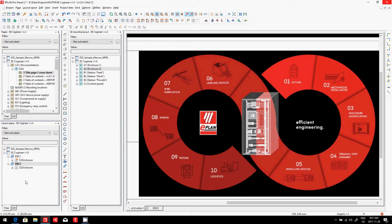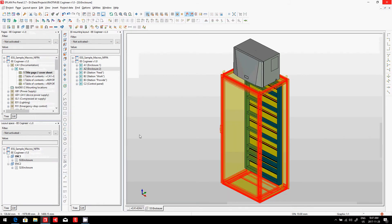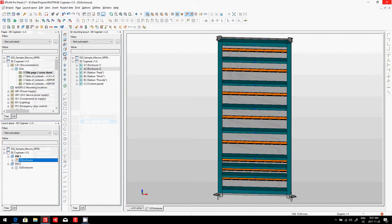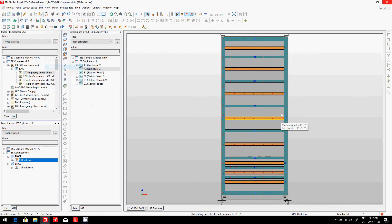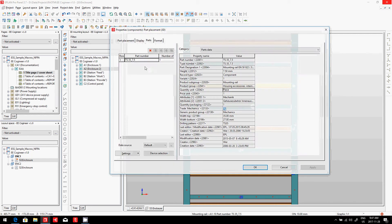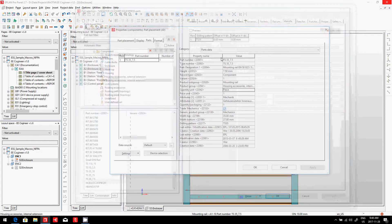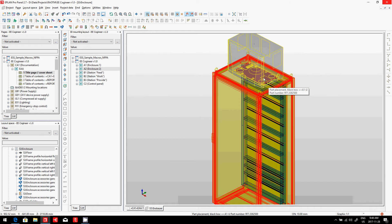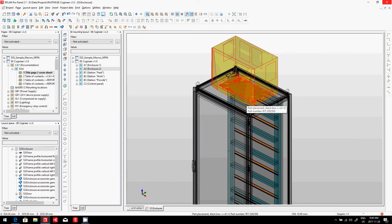How can we prepare this? Fairly easy. When you're back in EPLAN and you actually build your panel layout, I'm going to open my enclosure and work right on my first mounting panel. As I place my components, I automatically have the drilling information that comes behind the scenes. I don't even have to populate the din rail — I already know exactly what I need in terms of manufacturing. This drill pattern specifies what size of hole I need. Everything is there. By placing this component on the roof, we also get some additional cutouts because of the AC system placed there.